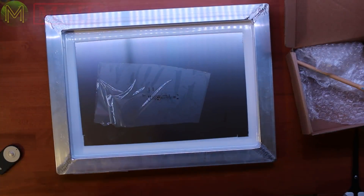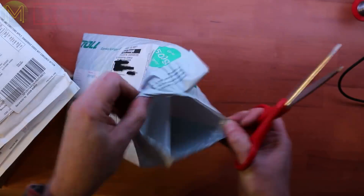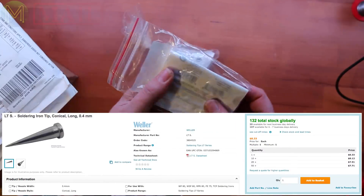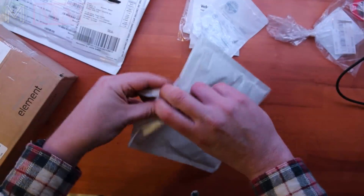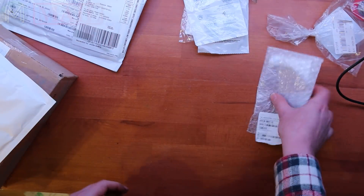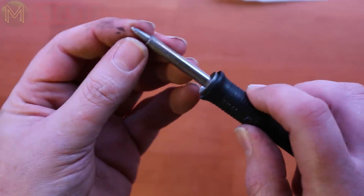Later in the week I got a couple more packages delivered — these all came from Element 14. Let's crack them open. These are some Weller tips for my Weller soldering iron that I bought some time ago. I've only just managed to get around to ordering some of these tips — got a 0.5mm and 0.8mm, and some 0.2. I also ordered a 1.2mm bent tip. I needed a 1.2mm and a 0.8 and 0.4mm soldering tip so I can do some surface mount soldering. The tip that comes with the unit is a massive tip, so of course I needed something smaller.